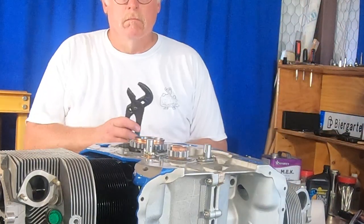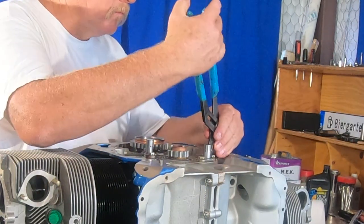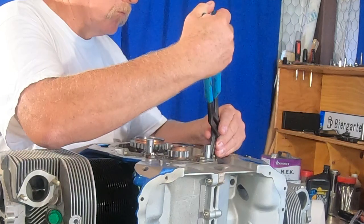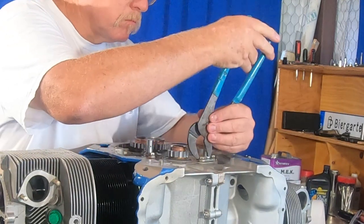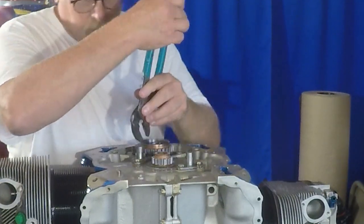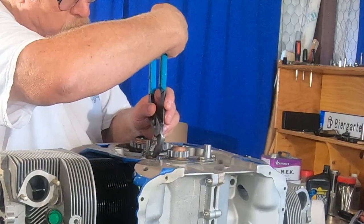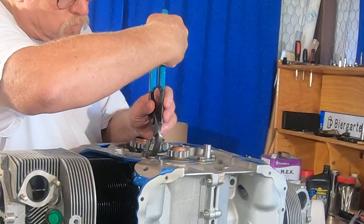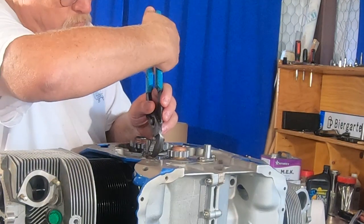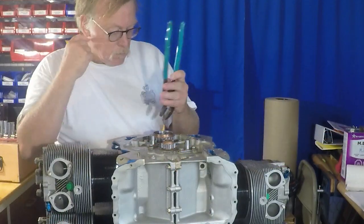Then once we have those bolts and nuts torqued, to bring the tabs up I don't start banging on it with a hammer or a screwdriver trying to jam them up. I'll just use a pair of channel locks, nice and gentle, and kind of roll that tab, get it going. I'm not grabbing it, I'm not scraping it, I'm just slowly rolling it up, probably about 80%. It won't get it as close as you'd like, and sometimes it pops off in close quarters, but I'll use that just to get the lock tab started, or mostly on its way.